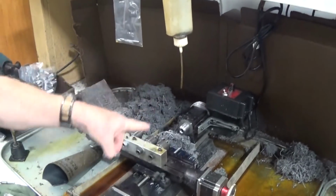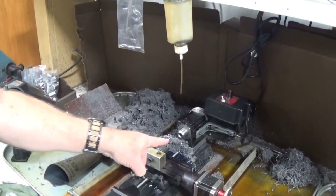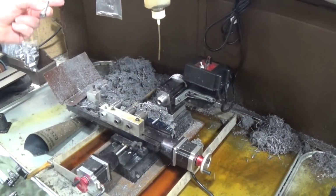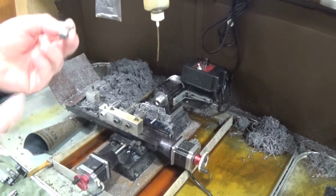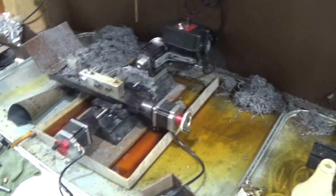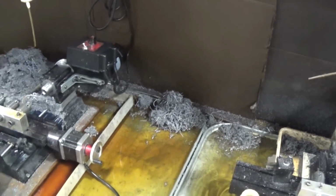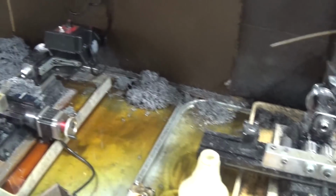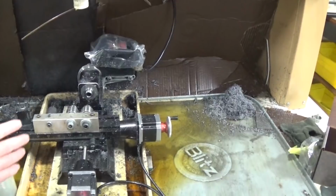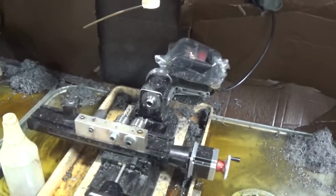So that'll get mounted in there, and then these 3 tools will run on that program. In, out, over, and then there's a parting tool there, because there's usually a nib or something that has to be parted off. These machines do some real work. Yeah, these are set up as chucker lathes. You can see it has a mill base. And it's a modified mill that acts as a lathe.